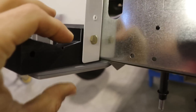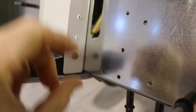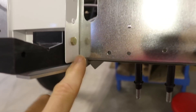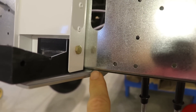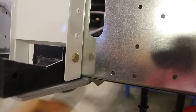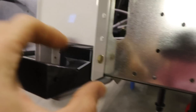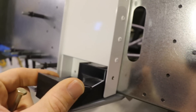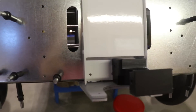What's really interesting is, before I did that, when I had this block in there, I'm trying to look in the hole to see how far it has to go — and there's really no way to measure that. So I just went to my box of aluminum and guesstimated about the thickness I would need. I cut a piece out, drilled the holes so I could put it under there, and it was absolutely perfect. I didn't re-drill the holes or open up the holes, and it lines up perfectly. So that issue has been solved.